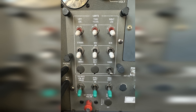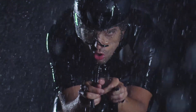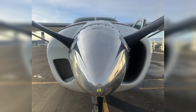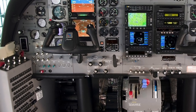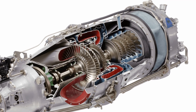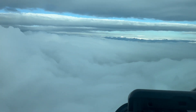Now, one last piece of information. Imagine running a race while breathing in large volumes of water, snow, or ice — it's going down your throat and into your lungs. Well, the airplane experiences the same thing. When you're flying through rain, snow, or ice, the engine is breathing in all of that through the air inlet duct. To prevent foreign object ingestion, engineers developed a sort of trap door or inertial separator. The inertial separator has two positions, normal and bypass. While in bypass, the heavy contaminants keep moving straight while the clean air bends and enters the compressor. The name is not just a label — it's a short physics-based explanation of the system's function.